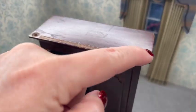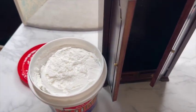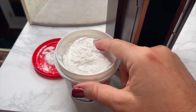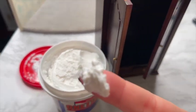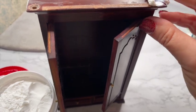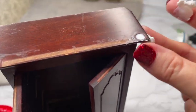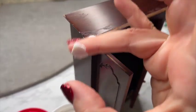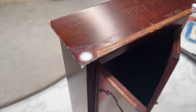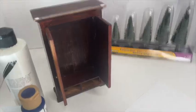I'm going to take this Red Devil One Time Lightweight Spackling and fill the holes inside and the little slats, and also fill the holes on the top where the finials used to be, in addition to where the broken molding was. I'll fill that in and sand it down really well. If you've ever used this stuff, it's very satisfying — it feels like a very lightweight, almost marshmallowy paste without the stickiness. Once that spackle is completely dry you can easily sand and paint it. I've gone ahead and sanded everything down nice and smooth.